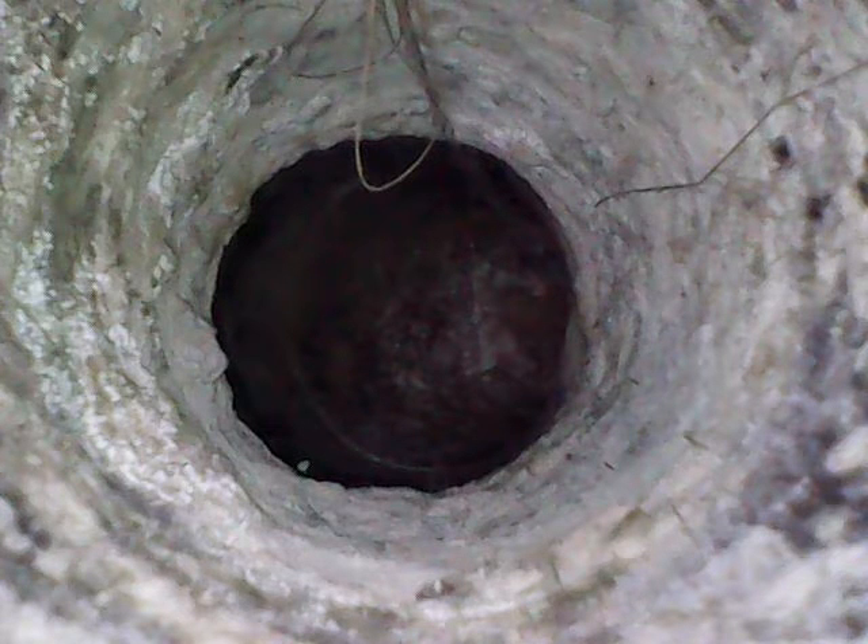This is the next picture — if you look carefully you can see strands of carpet, cat litter, and hairs down there at the bottom at the hair trap or S-bend in the pipe. Like I said, to focus it all you do is move the cable in and out and adjust the light level. This thing has great features — you can also rotate the screen to four different angles if you want. At the 12 o'clock position you can see how well it focused the hair in the drain. Once again you can see the alkali buildup, and in the very center that's the bottom where the pipe turns into the S-trap.